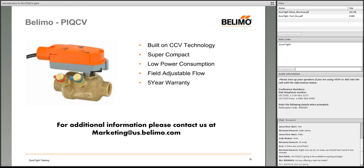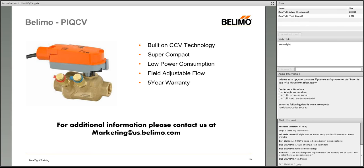Question: Are you offering a readout meter? We don't have an electronic flow measurement device with this product. We do offer the optional flow orifice device discussed earlier. Regarding the differential taps: those are for reading whether you have the minimum 5 psi pressure drop to achieve pressure independence — your TAB contractor would have that type of equipment.